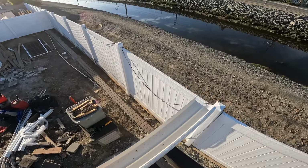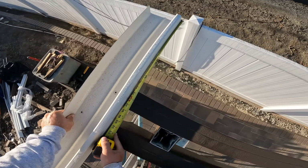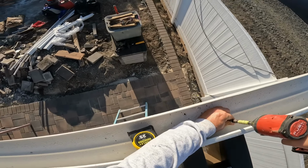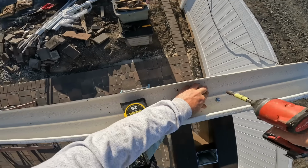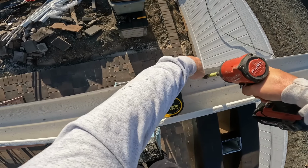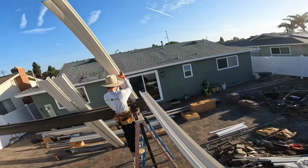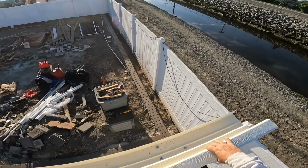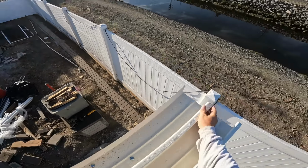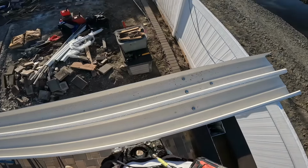And make sure you don't check your measurement before we screw in. We want to get exactly 14.5. I got 14.5 exact. What do you got right now? Okay. Alright, that's it then. Good? There's one. This has a little cross slope on top. I think they gave it 2 inches of slope in 10 feet. You flush? Yep. Flush. And we're off to the races.